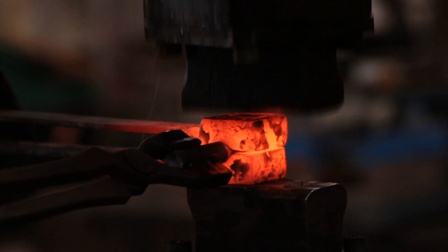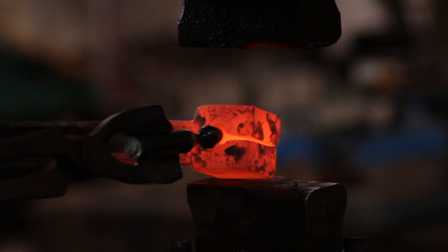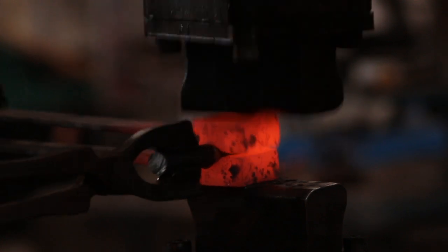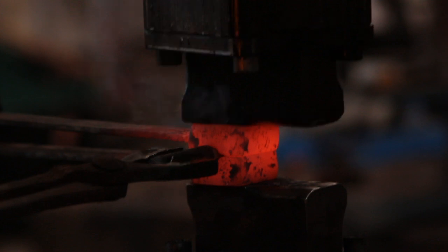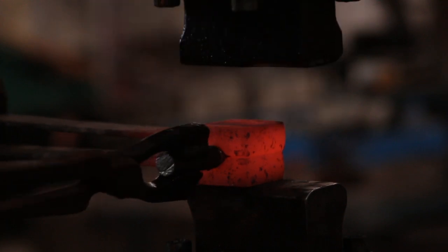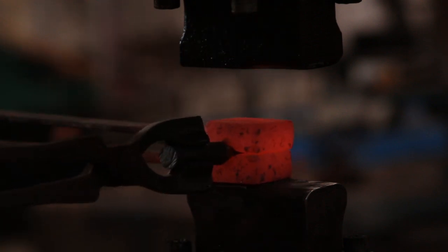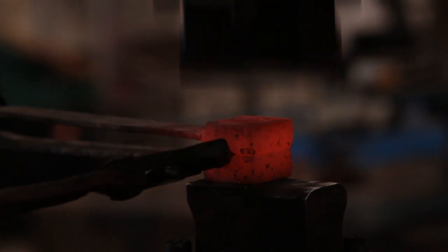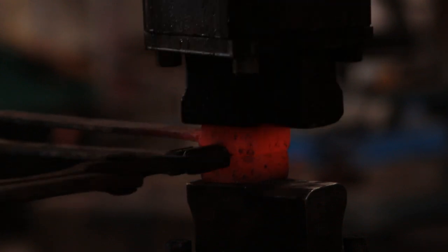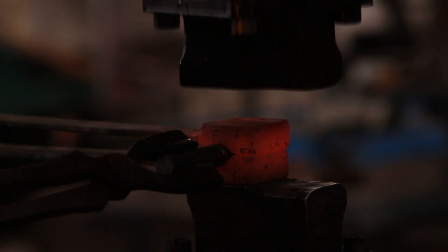I did this in a single heat and let the swage cool down to quite a dull red temperature, and that is purely to planish the pattern on the inside. Quenching the template also helps blast the scale out of the impression and keeps it clean. I'm going quite tight with the swage — both halves are now banging against each other, and that will drag out the corners of the impression, making slightly more rounded edges, which means there's less chance of galling the acorn you're trying to form.